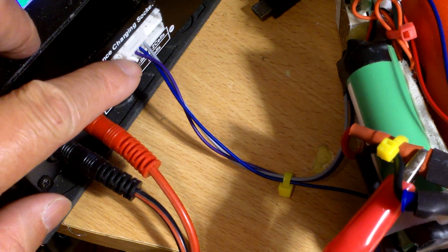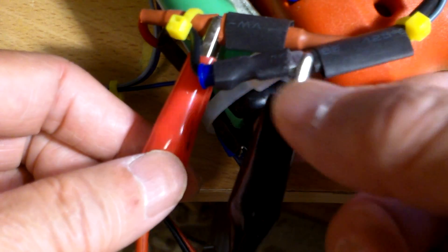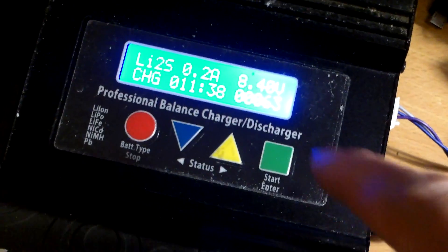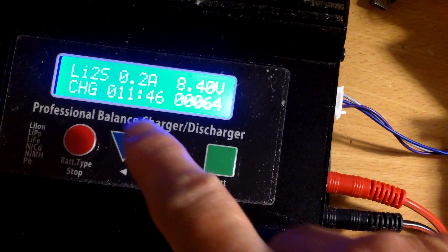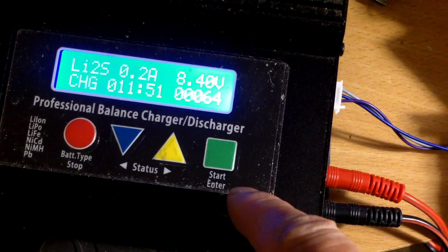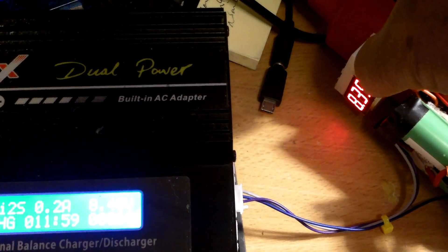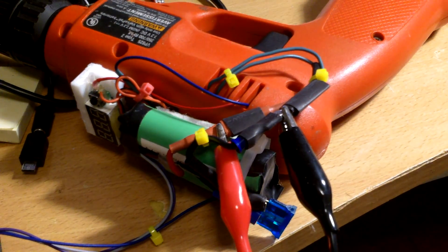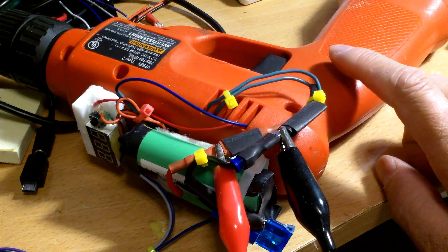Anyway, this is an IMAX clone B6AC. It's working out — I just plug it into the three-in-series balance port, then use the alligator clips from the charger and clip them to the spade connectors here, negative and positive, and it's charging. 4.19 — point 2 amp charge now. There's an LED meter here I'll show you later. It's at 8.39 volts and it's just finished charging.